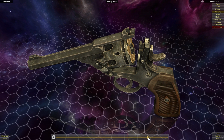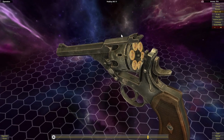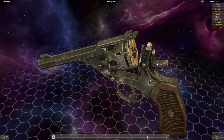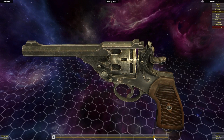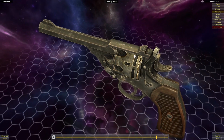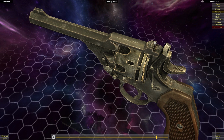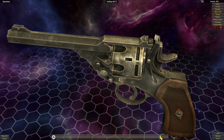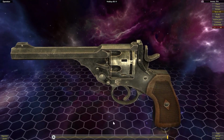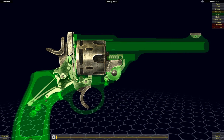You could just allow the frame to contact it, and due to this rounded surface, it would just push back on the latch until it got firmly in place within this lug here, and then the latch would just automatically snap back in place due to its return spring. But you could also activate the lever here to bring the latch back if you desired, like what we see in the animation. In principle, this is a simple design.